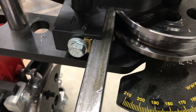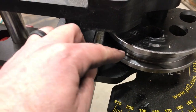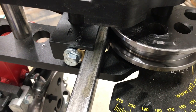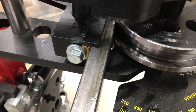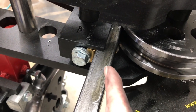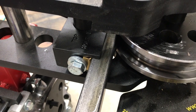Once you get your tube installed inside the bender, make sure that you oil the living bejesus out of it. You can use a tube lube, but once you think you've used enough, use some more — because if you ever get tube, especially square tube, stuck inside a die, it's super unfun. Ask me how I know.